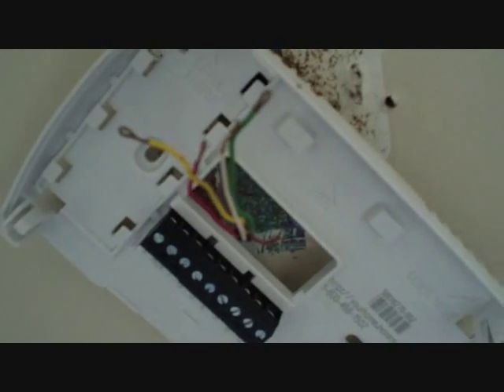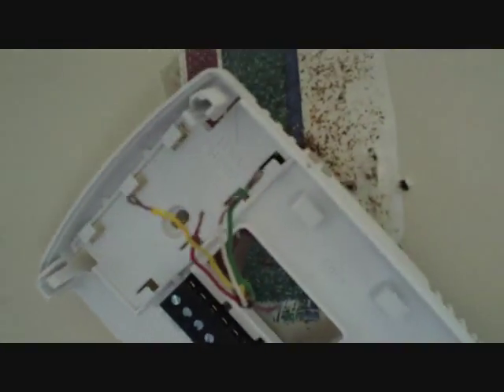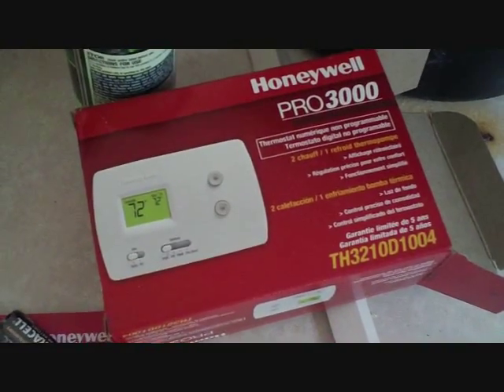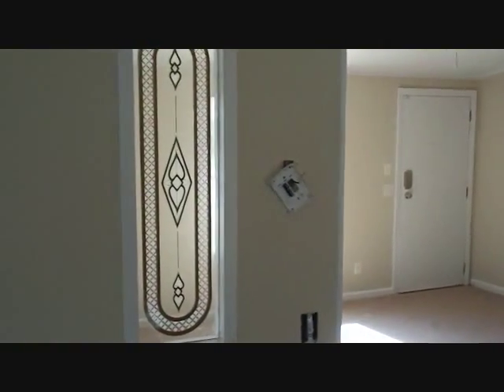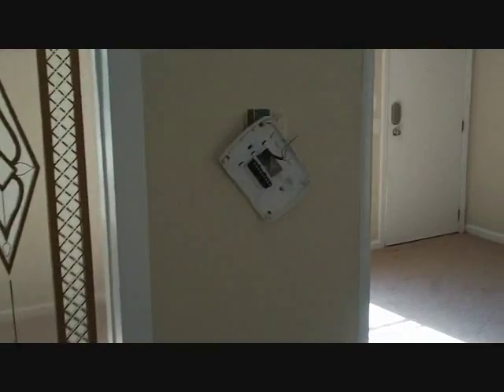On to the thermostat wire. The good news is I thought it was a two-wire — I don't know why I thought that. It's actually either a seven or eight wire because they cut off some of the conductors, so we can use it. Good news. So we'll go ahead and mount our Focus Pro 3000 — it's a more economical Honeywell thermostat, but still a really good stat. I like to use this on the lower-cost jobs so you still have a good stat even though you don't want to pay a ton for it.